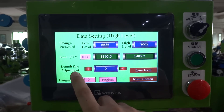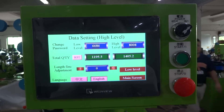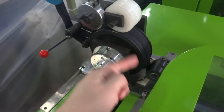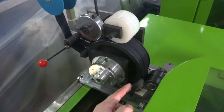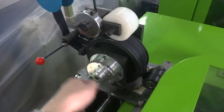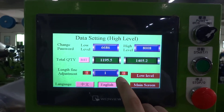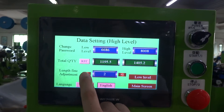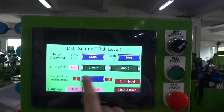The fine adjustment: when you set up 200 meters it sometimes comes out shorter. You can increase the length by every round — for example, one round is 4000 pulses. You can add one plus and you will get more. This is the per-round pulse increase. If you always get shorter, increase from here. If you always get longer, decrease from here. Normally we set it to zero.